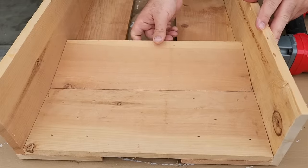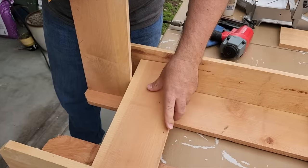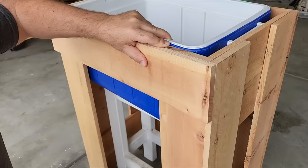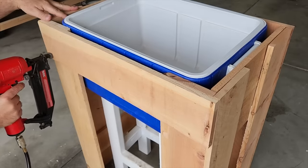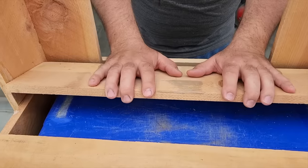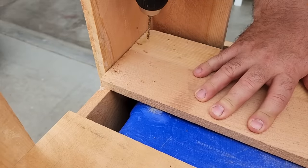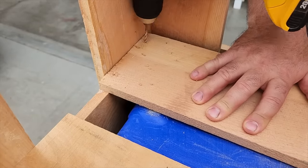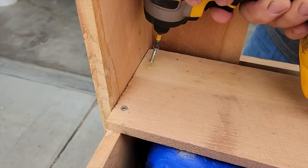If it fits, let's put another board on. That way we can cover up the whole cooler. Also, let's go down towards the bottom — make sure we put some there too. That's going to give it some support. Now it's time for the long side. We're going to put a board on the outside and cut it to fit, and we need two of them just like the other side. Once we got those on, it's time to build the bottom. I turned the igloo over, put the cooler stand back up on its back and screwed it into place instead of the staples. There's going to be a little bit of weight in that cooler and we're going to make it super strong.